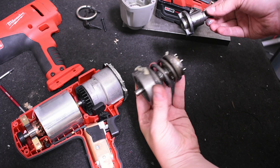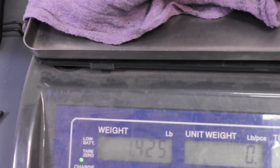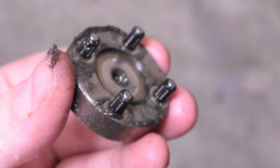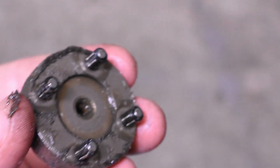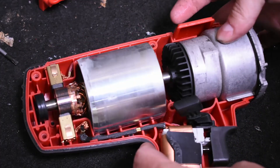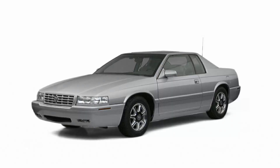This whole assembly is not super big, not super heavy. While the Milwaukee 2767's hammer assembly comes in at a very heavy two pounds four-and-a-half ounces — some of the heaviest we've seen — the 0779 M28's comes in at just 1.4 pounds, quite a bit lighter. Further down, there's yet another planetary gear reduction with four planets this time, driving the second sun gear using four pins, and each of those pins has its own needle bearing — over-engineered to the max. A lot of that double reduction is due to the still quite large brushed motor which, despite its size, doesn't hold a candle to the latest Milwaukee Fuel stuff and therefore needs to be gear-reduced down quite a bit — two stages. The spring and hammer mass reduce all that to work efficiently without bogging the brush motor down. All those bearings do make for a sweet ride, sort of like the Cadillac Eldorado of impact wrenches.